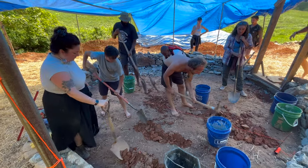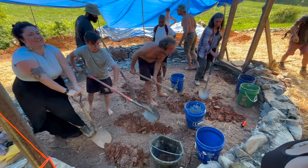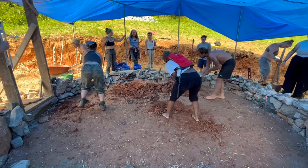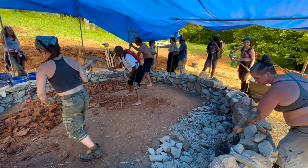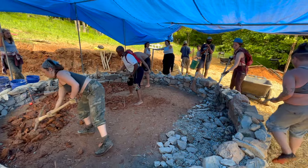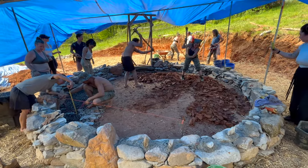We again use shovels, mattocks, and spades to dig the areas that were too high, checking with a measuring tape periodically to ensure that we were digging to our desired level. You can see that as we dug out the high areas, we also filled in the low areas to bring them up to level with our 3/4 inch clean stone.